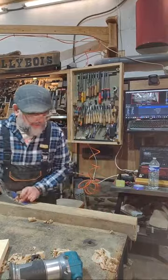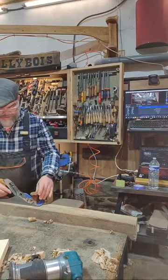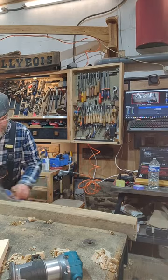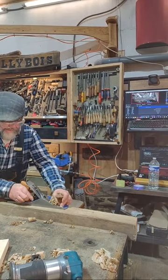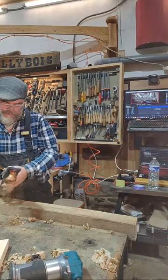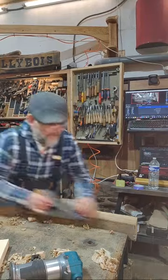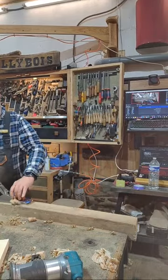If the wood is crap on the surface, which this is, you might have a situation where you end up pushing shavings between the plane iron and the chip breaker, because you're not creating proper shavings peeling out, you're creating this mess. All this crap to start with. Slip through the end of it. Oh, I've got a horrible piece of wood.